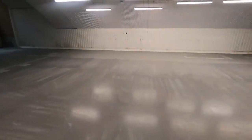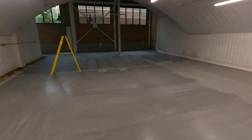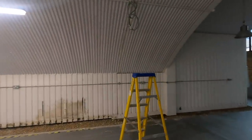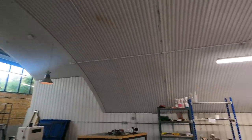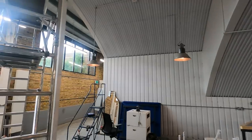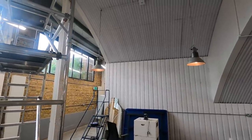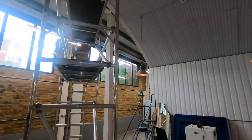Right, this was the main area where you had all them tanks, and the little switch room was over in that corner there. Most of the lighting is up but I think there's a few more to go in. They want one light over there, one in the middle here, one there — so one, two, three. And these lights here to come down — three fluorescents, one, two, three. There's a burglar alarm fire sensor thing as well, get rid of it, and the same with that one on that wall. I might have to alter the conduit there.